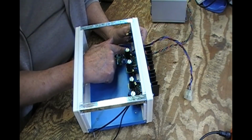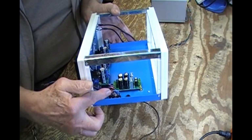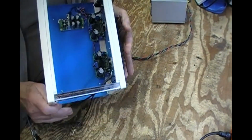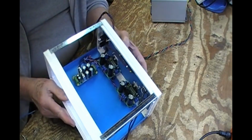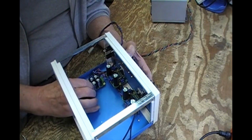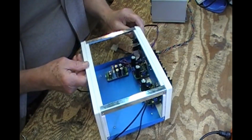So, from the plus and minus input, which is about 35 volts, about 30 maybe, into a connector here that's just a tie point, each one is fed separately from a twisted pair into each input, and also a twisted pair into this regulator, which also has a rectifier and four filter caps, and then the regulator ICs, positive and negative, to give me plus and minus 15 volts out. Okay, so we're at that point.